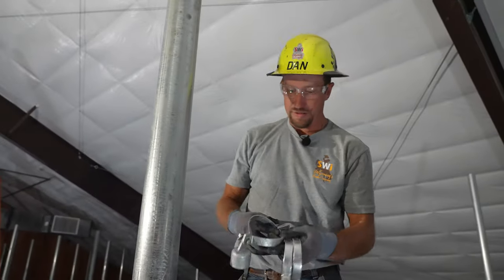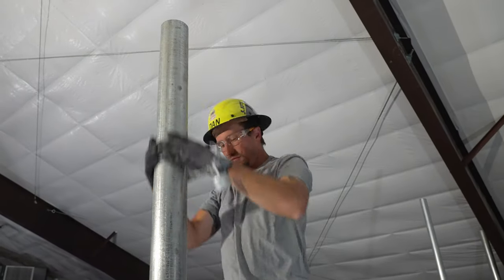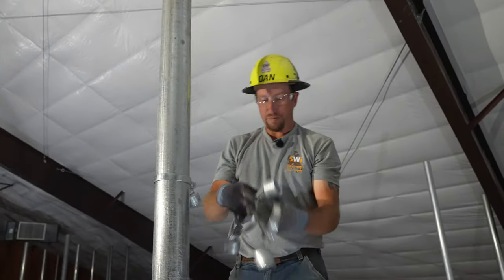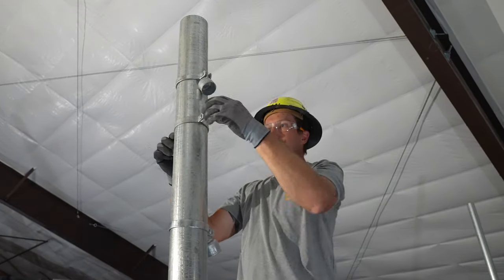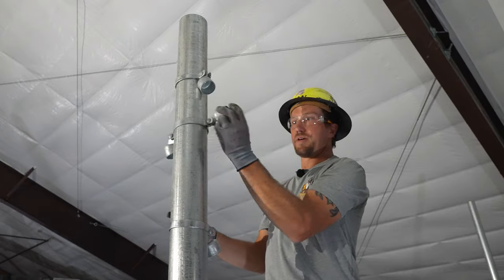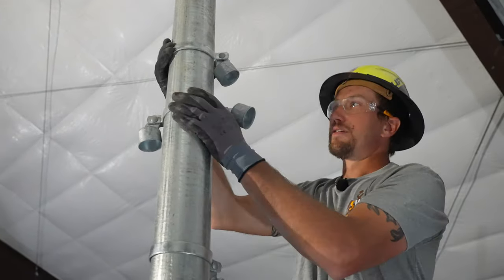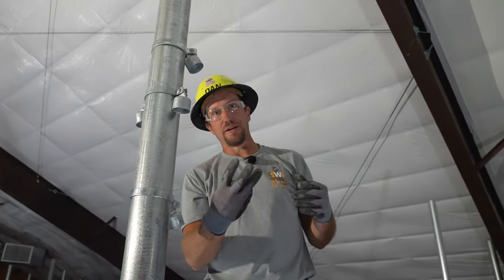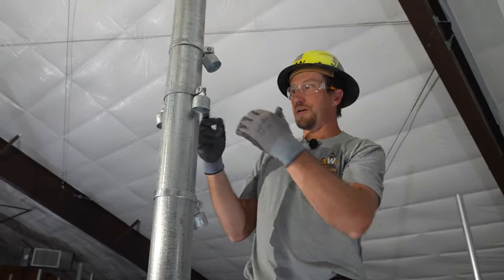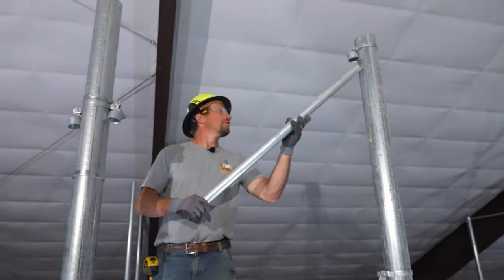So now we're gonna do our rail ends again. This will be for our middle rail, the rail that comes off right behind me. And we're gonna do our top rail. And the one on the top, so my bottom one I have going up, my top one I have flipped so it's going down. Now the benefit to using a 2-way brace band versus using 3 brace bands on a T-post is you can make all 3 of these top rails in one uniform line.